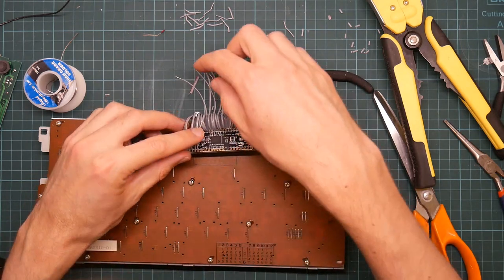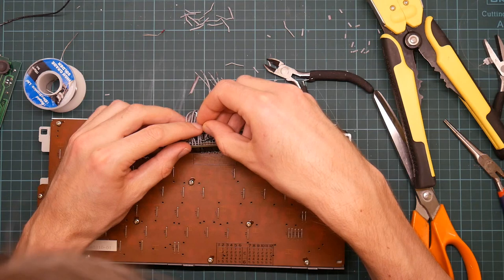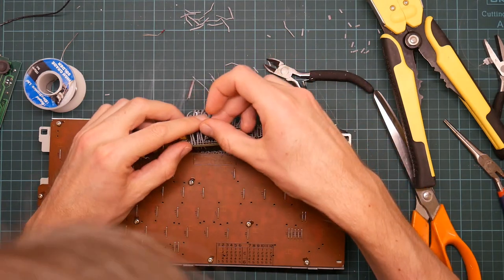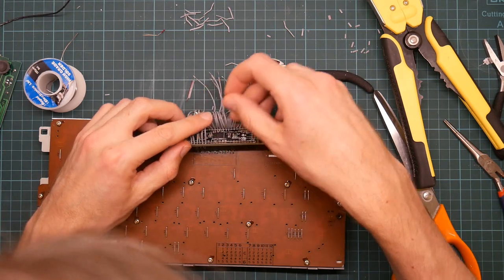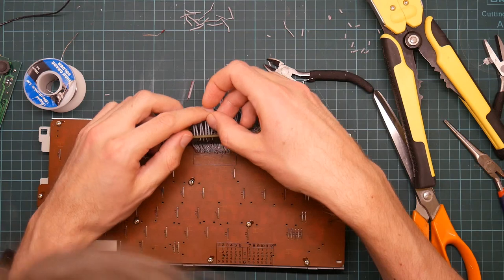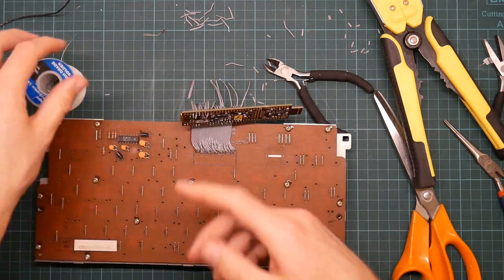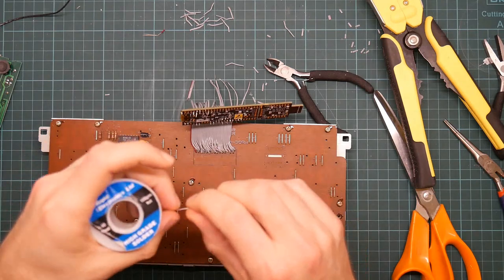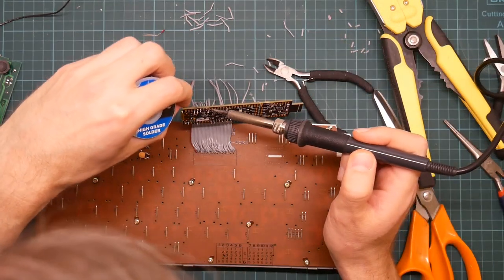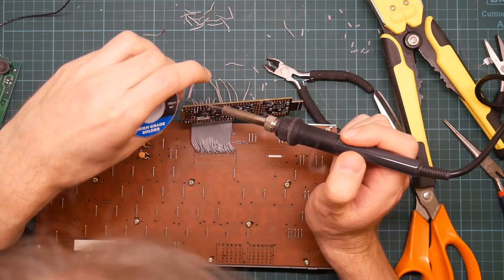So these two here are the ones I need to skip because they're the ones used to program the board. Depending what they're used for, they could be shared. Like if they're just switches, then everything will be fine, as long as I don't try to program the board with a key pressed, which will cause the switches to be either grounded or made high. But we've got lots of pins, let's just avoid them.